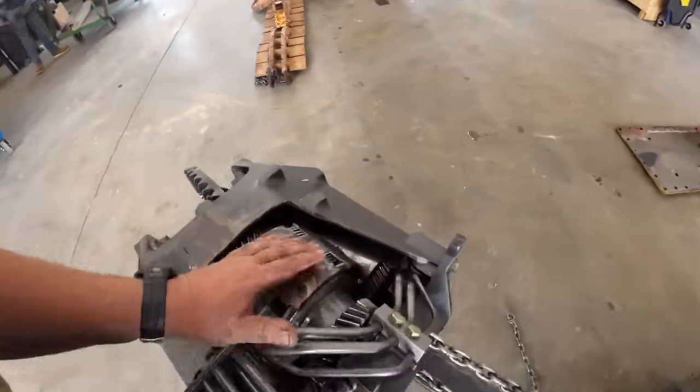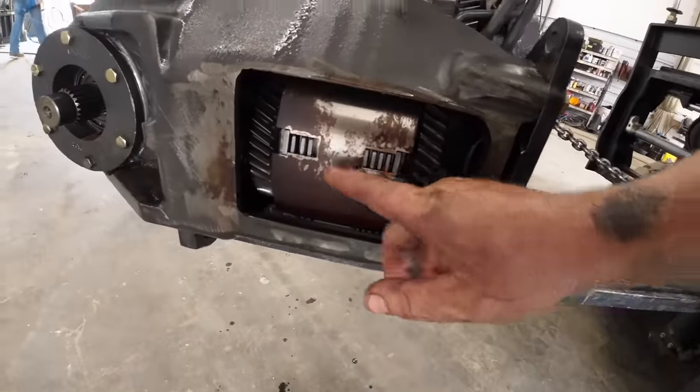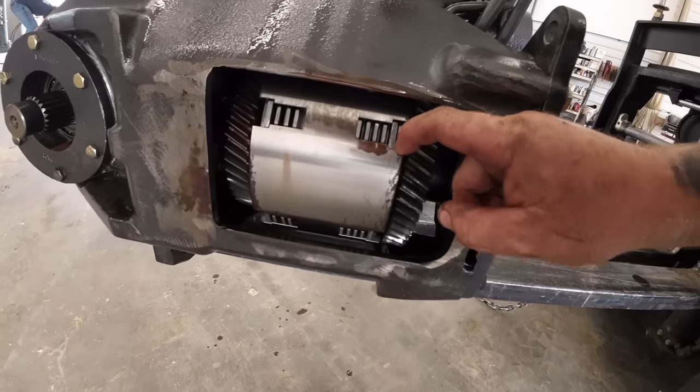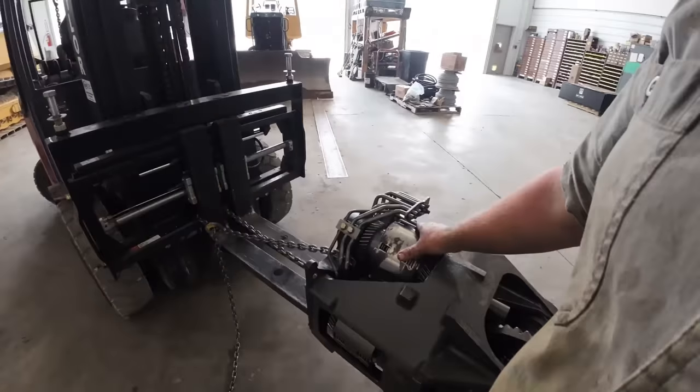Another gear drops out of them a lot. They get a lot of wear and tear. Second gears get used a lot in them. But those aren't looking too bad. But being old as it is and the way the oil looked, we'll go through and replace all the transmission discs and make it all right for the next owner.